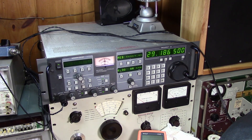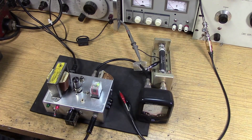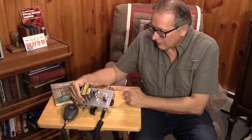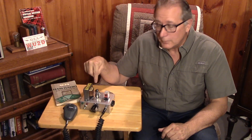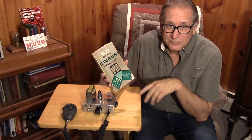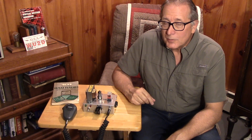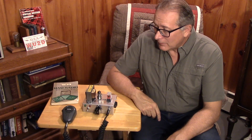I'm going to declare victory - the little transformer went on the transmitter just fine. Testing one, two, three, four, five - hello test! Can you believe it, we got it working. Not easy - I had to get the correct ratio transformer and nail it on the back before we could get the Shure microphone to completely modulate the tube. We learned a few things along the way with these little projects from books like 101 easy projects - sometimes they're not that easy to get working.